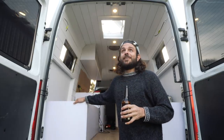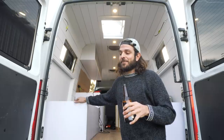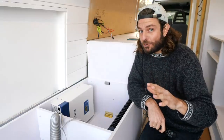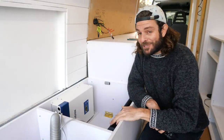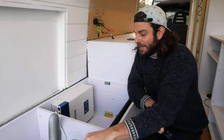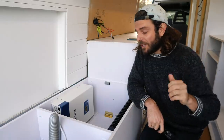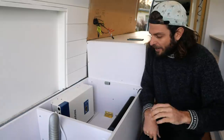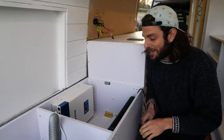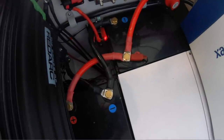Good timing too, because it is starting to get a little dark and I still want to show you the system. This took a lot of work, so I'd like to quickly run you through exactly how it works, considering we now know that it is working beautifully. Here's a quick system rundown: starting with two 12-volt Solar King lithium batteries, hooked up in parallel, which means it stays 12-volt and it's 400 amp hours.